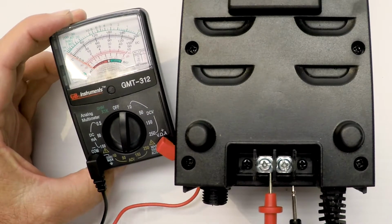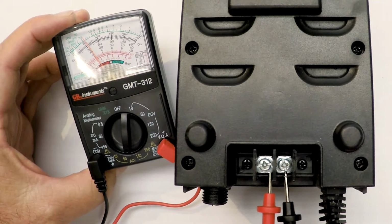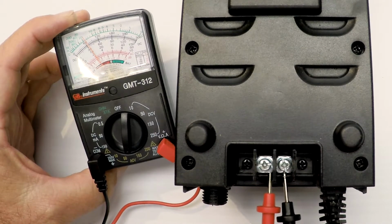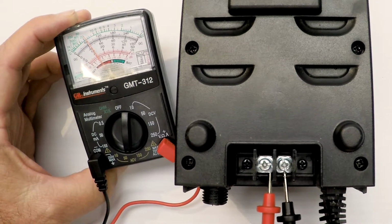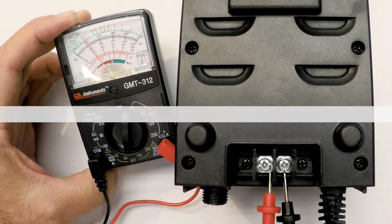So here's the meter next to it, and I put this on, and it's registering 12 volts. As simple as that. Now I know that this transformer is good. I know that for sure. We do get a lot of people who say, hey, my transformer is not working. Well, actually, it's something else that's not working. And of course, we're going to cover that in the next videos.